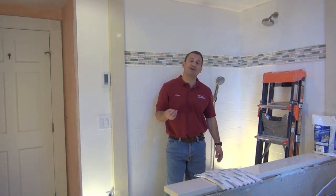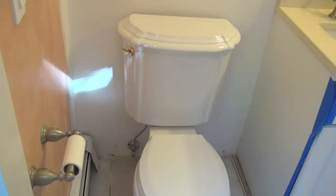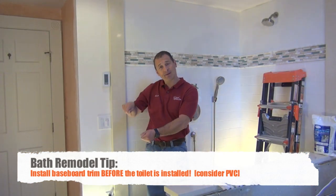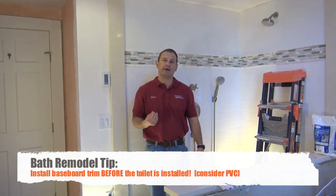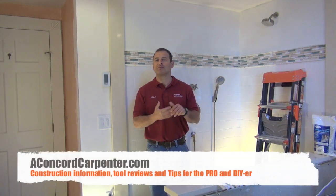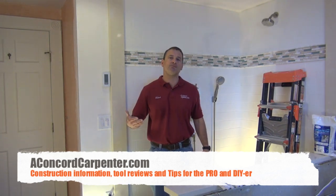One final tip I forgot to do this time: if your bathroom toilet is installed between a wall and a wall, or a wall and a vanity, install the baseboard before the toilet goes in. Otherwise you've got to try to fit a piece of wood in there tight or splice two pieces together. I'll often use PVC board with a base cap on top behind the toilet — for obvious reasons it can be a wet area, the toilet can overflow, and if you've got little boys, sometimes there's overspray. By using PVC, you won't have the problems you'd have with wood.